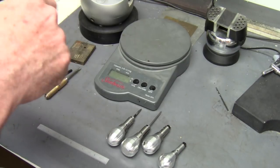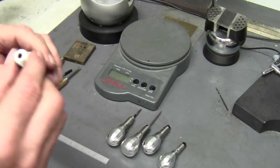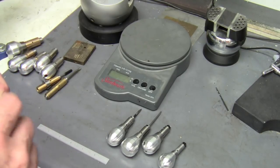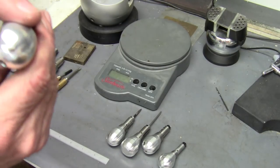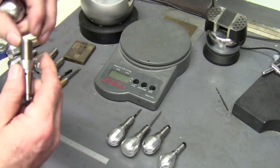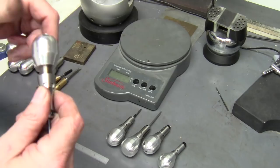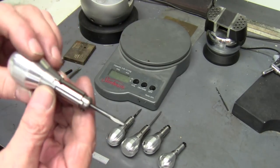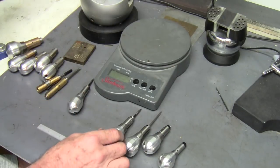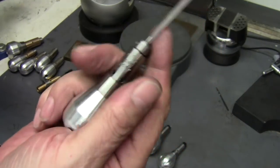These are the ones I'm making now. This has a .375 bore and I'm down to .350 now — it gives me a little more wall thickness. This one has an adapter, which was something else I tried. Sean kept saying he wanted a way to fine-tune these things, so I put a little screw in the back off-center and a spacer so it can be fine-tuned — but you really don't need it. It tunes just as easy by hand.